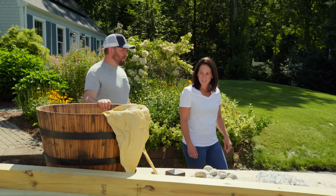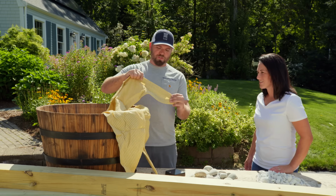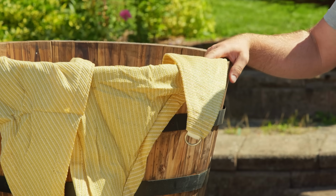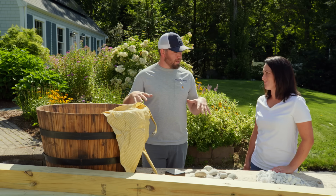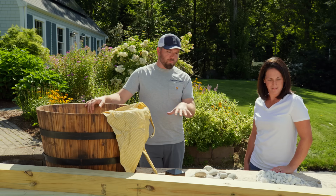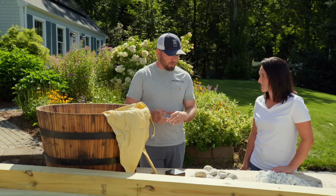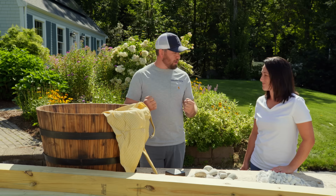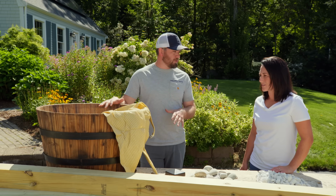All right, so what I think we should do is hang up one of these large shade sails. They're lightweight, easy to install. It's gonna look great when we're done. But we don't really have a lot of structure around that area. We don't have any buildings that we can tie off of, so we need to create our own structure. The way I wanna do that is by using these planter barrels and some pressure treated lumber. I don't really wanna put the posts fixed to your concrete apron. I don't wanna introduce holes, tapcon down into that and have water go in and split and crack over time. I think this will be a great option because it'll be customizable. If you guys need to move it, make it bigger, just take it down completely. You're not fixed into one spot forever.